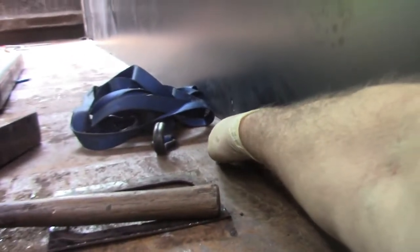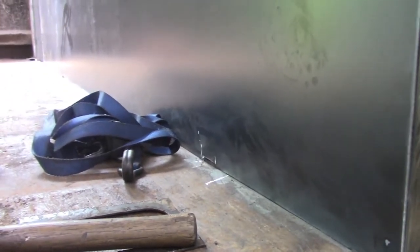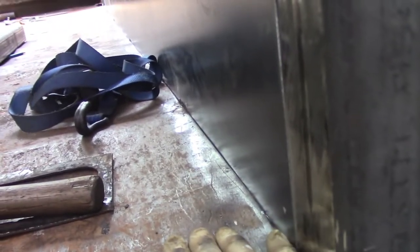So the remainder of what I need to do, and I already did it to this sheet, is every place where there's going to be a weld, I notched it to relieve it so the sheet would skip over the weld, and then when I go and stitch the sheet back in, I will stitch the sheet into the weld that's welded to the vertical tubing. I also made this fit so it drops down on the outside of the sheet that is the floor of the dump body.